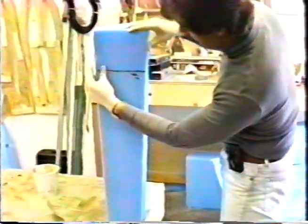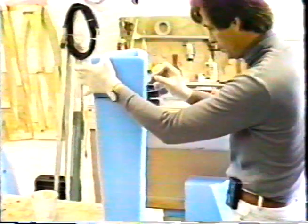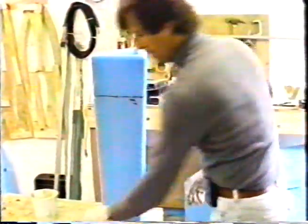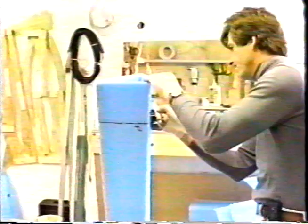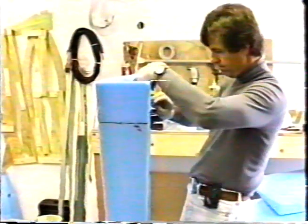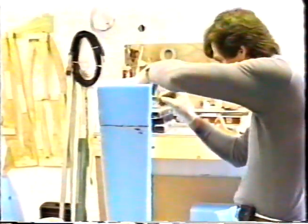The most important part of this is this face right here, and the height on the spar cap faces here and here. Make sure that they're flush and that they're back in their original positions. Slightly out of plane. Don't be at all resistant to putting it where it belongs.